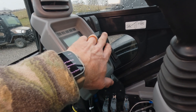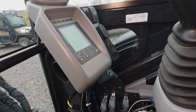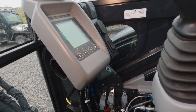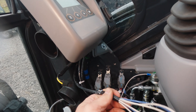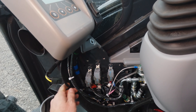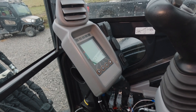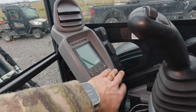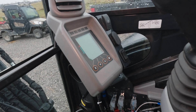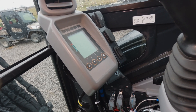I did put in a single pole, single throw switch initially — I realized my error because you need a double pole, double throw for it to work. I pigtailed those out and stuck it down here; that would be excellent for an auxiliary light. So I just threw that down there. Then for the main switch, I took the blank out and put it in. I'll put a link to the switch on Digikey so that you can find it.